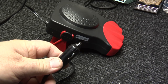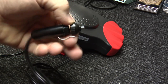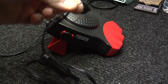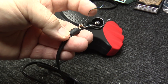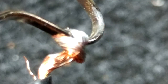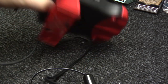Here's dead giveaway number one — let me show you this. This, on a quality product, is usually a fuse holder. There is no fuse in there at all. In addition to that, these little forks are the negative portion of the wiring, and as you notice, the wire is flexing but this solder joint is so poor that you can actually swivel this negative tab around on the wire.